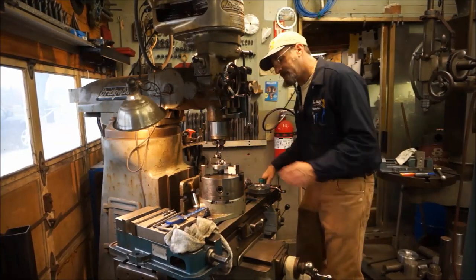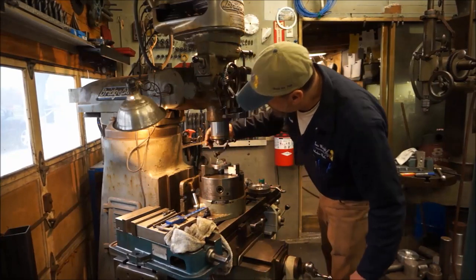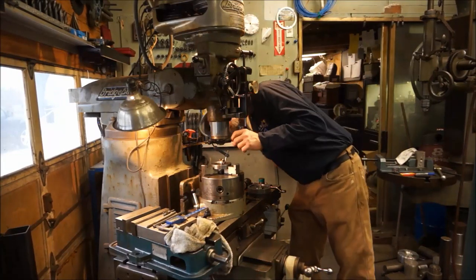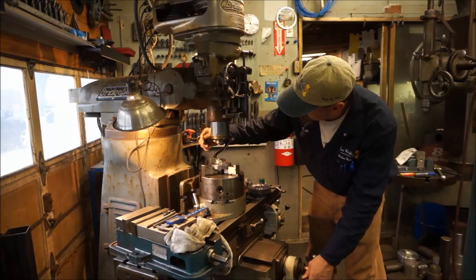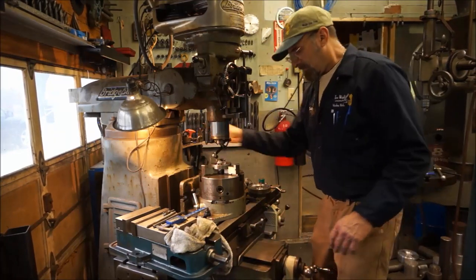Okay, we got plus, and we're on the minus there. That was plus five. We're plus five. I'm going ahead and we turn it. We get plus five there, and I'll just look over here, and we're like plus six, plus six, plus four. Okay, now we're that close. We're within a thousandth of all the way around.